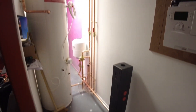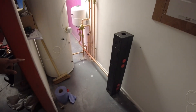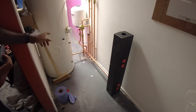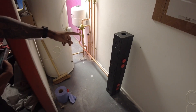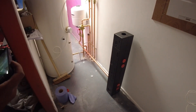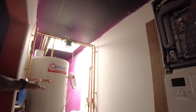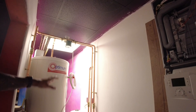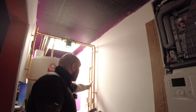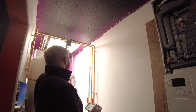That's the main heating pipes — a 28mm pipe at the bottom right there, that's the return. We've got the flow going into the top of this on this side, with a pump adaptor. The hot water cylinder's already been packed up, everything else has been packed up. We've got the hot water draw — this one here — and the secondary return.